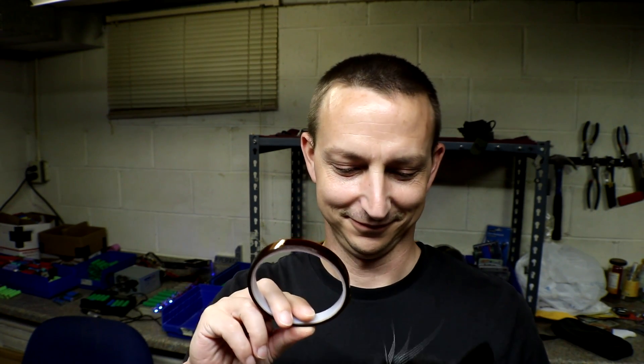Today is going to be a quick video. I'm going to pull out all the packs out of the server rack and check them all for bad fuses or bad soldering. I also got some Kapton tape — this yellow stuff. It's kind of a love-hate relationship with it, especially for tearing apart packs, but it sticks pretty good. I'm going to wrap the positive end so it's more sturdy and won't move as much when I connect or disconnect the packs, hopefully preventing more broken fuses. I'm also going to move all the voltmeters to the same side so I won't have to run back and forth to check voltages.